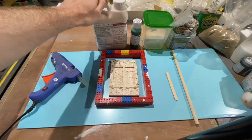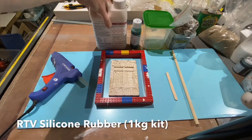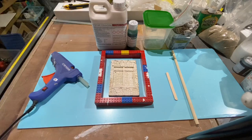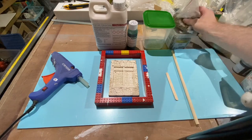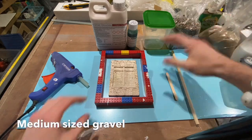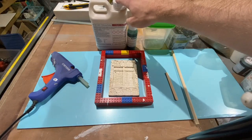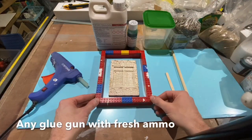Time to get on with the mould making. So I've got things in place so I can show you what everything is. This is the silicone rubber - the majority of the bulk is this uncured rubber, then we add the catalyst in a 10% mix. Once I pour it, it will set overnight. I've got a pot to mix everything up in, including some stirring sticks. I've got some gravel here - though you can use rice if you have any spare - to pour over the mould to gauge how much rubber I'm going to need, because this stuff is a little bit pricey and I don't want to get it wrong. And I've got my hot glue gun here so that I can seal around the outside of the mould.